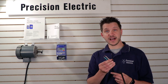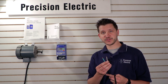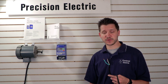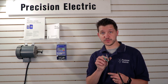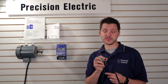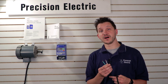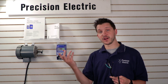I'll be wiring the hot wire to my hot lead, my neutral wire to neutral, and my ground to ground. Other than that it's pretty straightforward — you have to essentially fuse one, two, or three of those wires depending on which ones are hot. It's general practice in electronics and electrical wiring that if you have any kind of hot lead, you want to fuse it. The manual itself actually has a diagram, so depending on the part number of the drive you're using, you wire one section hot and you wire another without a fuse.